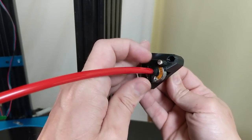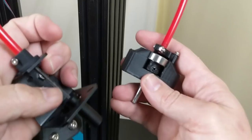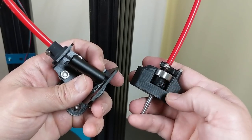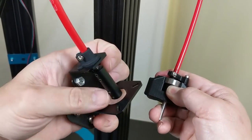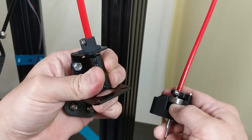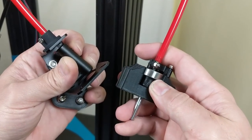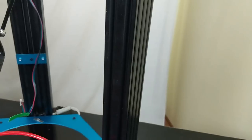This is the solution I've come up with. Let's bolt it onto the printer and do a test print. I've already identified a potential problem: I'm still getting cable wind-up. I'll hold here with my thumb so it cannot move, and you can see I can still flex on the other side — that cable winds up like a big spring. I'm hopeful that I can correct this using pressure advance. The pressure advance feature in RepRap firmware running on the Duet control board should be able to deal with it if the springiness isn't too extreme.